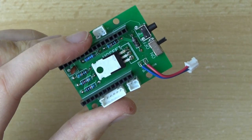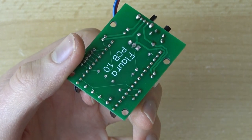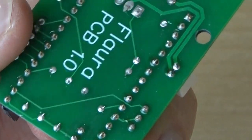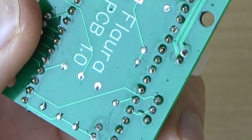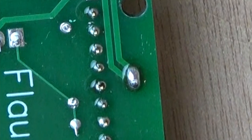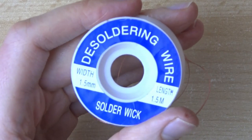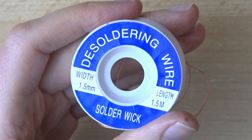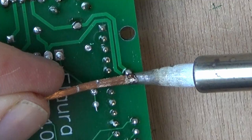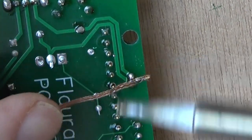And that's it. Now give each solder joint a final check and make sure they all look correct. In particular take a close look at the JST connectors as their pins are quite close together. If you accidentally created a bridge there or anywhere else you can still rework this spot. The easiest way to remove excess solder is by using solder wick — simply place it on the joint while heating it with a soldering iron and watch the capillary forces suck out the solder.